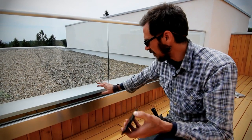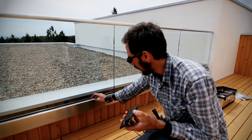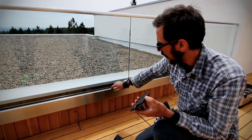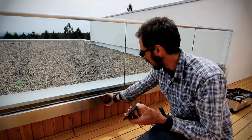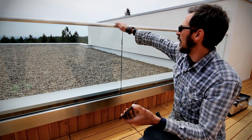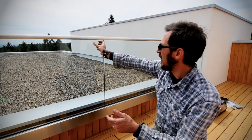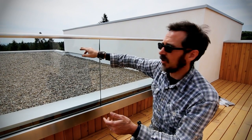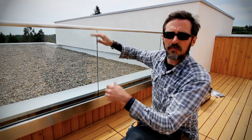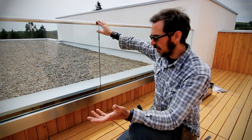After all the glass pieces are in, you install a bunch of cladding. This cladding piece is a piece of stainless steel that's broken and gets epoxied on or attached with heavy-duty double-stick adhesive. Then a little gasket gets slipped in. Then we cut and fit the railing parts, which are really easy — just square cuts — and they provide fittings that go around corners, end caps, or couplers for butt joints. That's really the whole system.